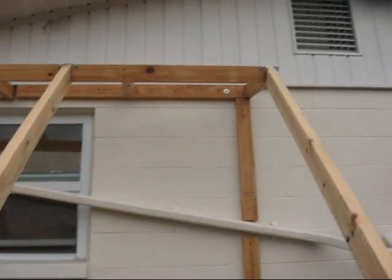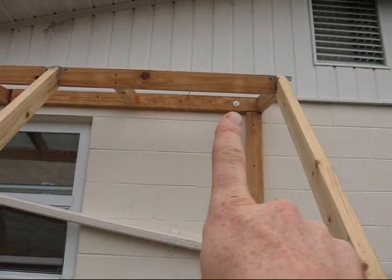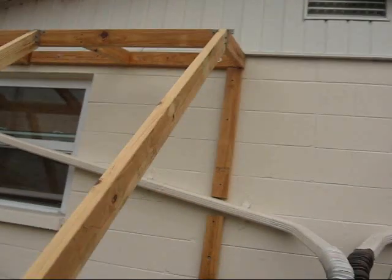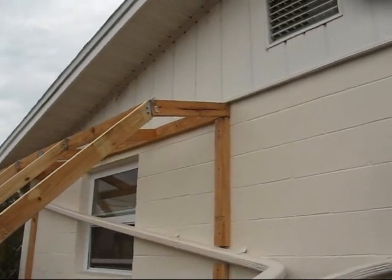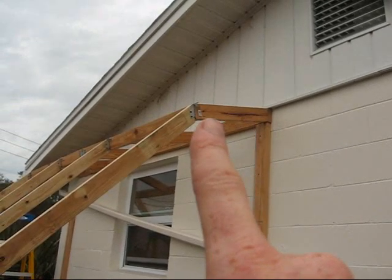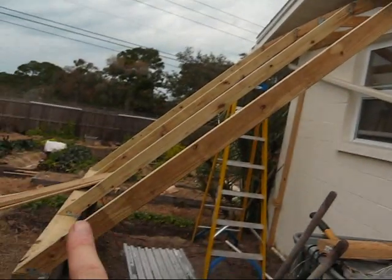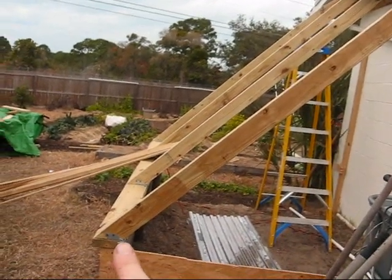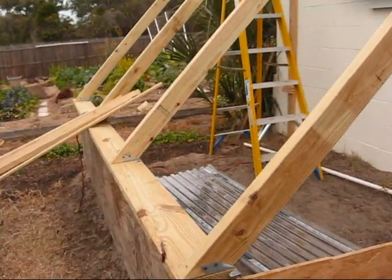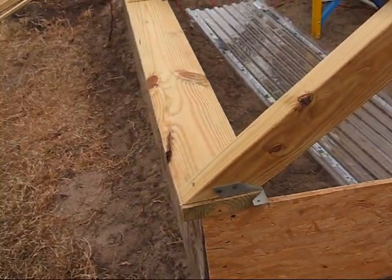I used lag screws — basically anchor bolts into the concrete block for the stud roof there, and that's about 22 inches. Cut them 24 and then cut the angles, so it's 22 inches, 23 inches maybe, at a 15 degree angle down. And I cut these about eight and a half feet long at a 30 degree angle facing down at a 45 degree angle at the bottom here. I have to break these off, but these things are a sweet find — I'm so glad I found them. Made my life a whole lot easier.